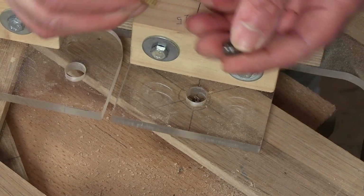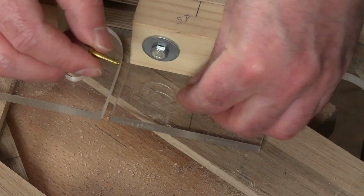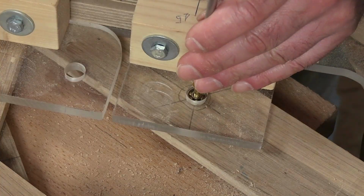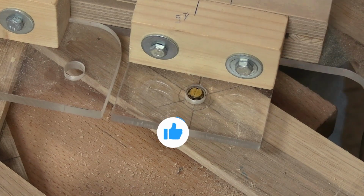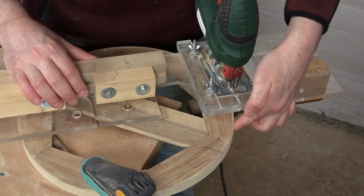Okay, I found a screw that fits snugly into the bearing. The previous screw was loose, and I had it adjusted with Teflon tape, the kind used in plumbing for sealing threads. And when the tape gave way, the bearing started to wobble. Now it is fine, but I have to readjust the cutting jig to this new size.